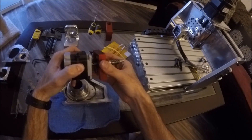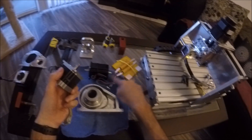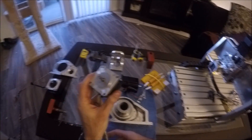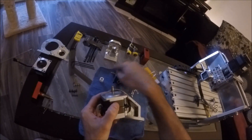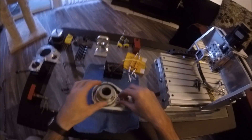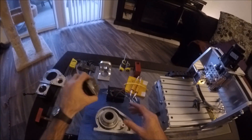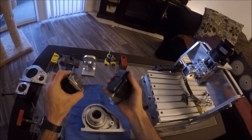It's kind of a light press fit on there. So what we need to do if we're going to use this motor with the tail shaft on here — and again, we don't need this big of a motor since it's like 30 to 1 or 60 to 1 gearing or something like that — is drill this cross pin through our shaft to get this to mount on that. Just wanted to show that, and I'm going to go in the shop and match these shafts. I'm going to take the dimensions of this roll pin and put it in this motor here.